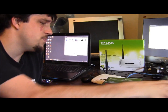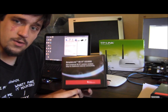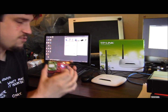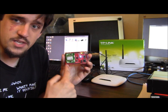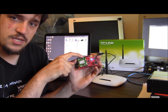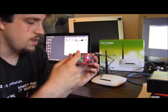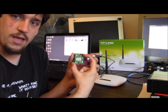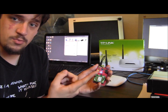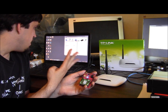It also comes with the CC3000 Wi-Fi daughter board, which plugs into a set of headers on the FRAM kit. Here's the board with a standard 0.1-inch set of headers for port 2 and 1, and this is the Wi-Fi board itself. Plugging in over USB, it shows up on your computer as a serial port, an HID device, a composite device, and an input device.